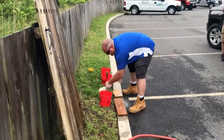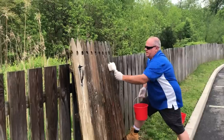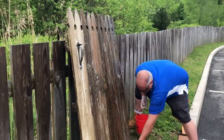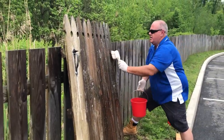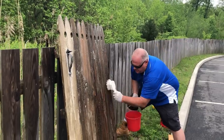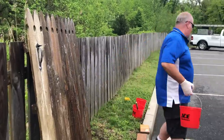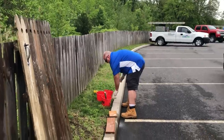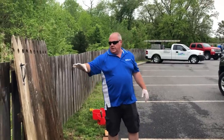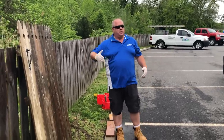Now sodium hydroxide as a cleaner. We're stripping it over here. We're taking the stain off. So we let that dwell. While it's dwelling, you're going to see the same reaction when you're working. You're going to see the chemical working, you'll suds up, so forth. This is what we have to rinse off when we're done here. So we're going to make sure we get a good rinse.